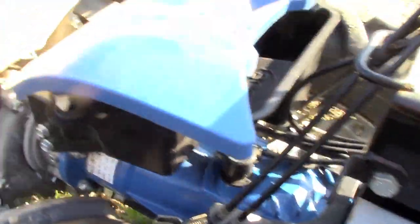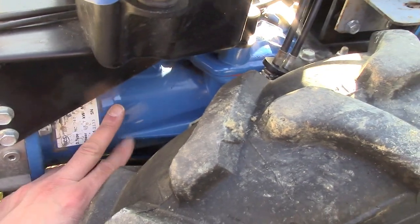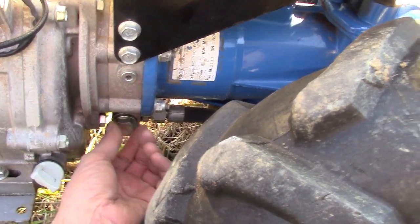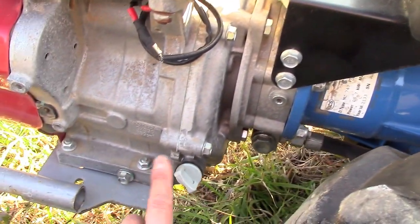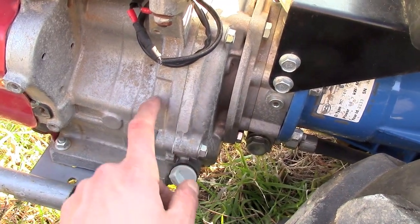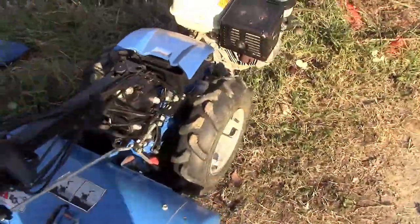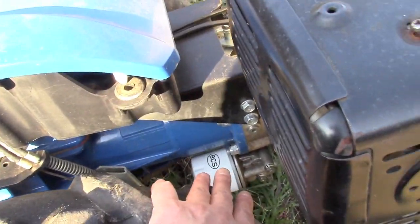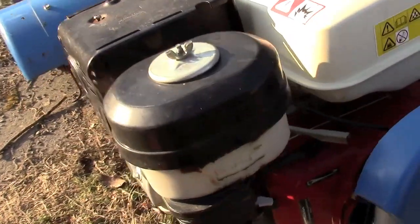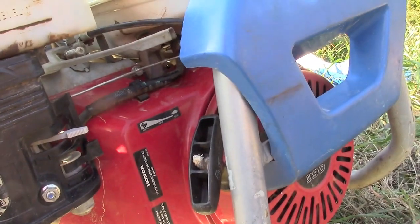There are two oils to consider on this machine. This is where you put oil for the drivetrain and gears — there's an oil system in here. This is where you drain that oil, and there's a magnet on here that will catch metal shards, which is pretty cool. There's also a filter on the other side. This separate location is where you drain and fill oil for the engine — that's just regular small-engine oil. The oil for the drivetrain is a different oil. There's also an oil-based air filter; the oil reservoir in there will catch a lot of dust if you're in a dusty environment.